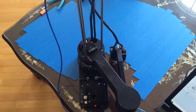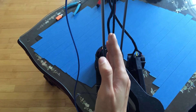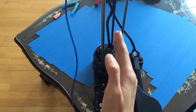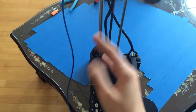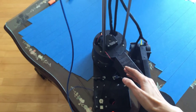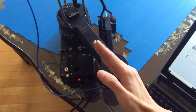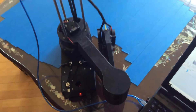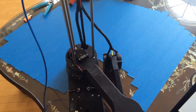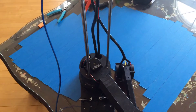So the angle between the upper arm and this arm is about 30 degrees, and going back to this arm the angle from here is about 150 degrees. Marlin's version doesn't exactly use that — what they use is a SCARA offset and a bent homing offset.